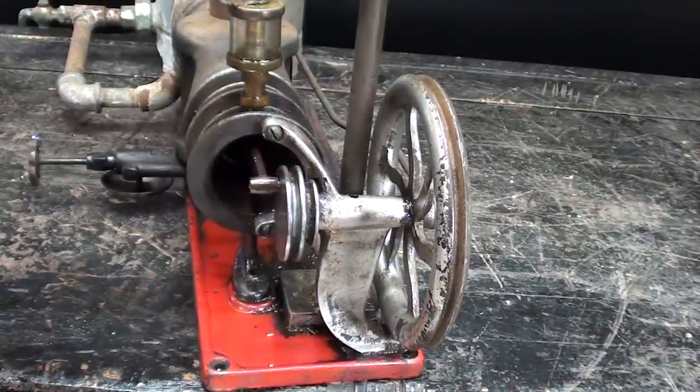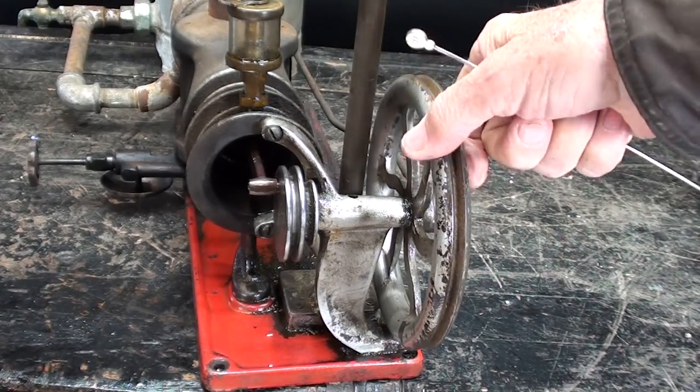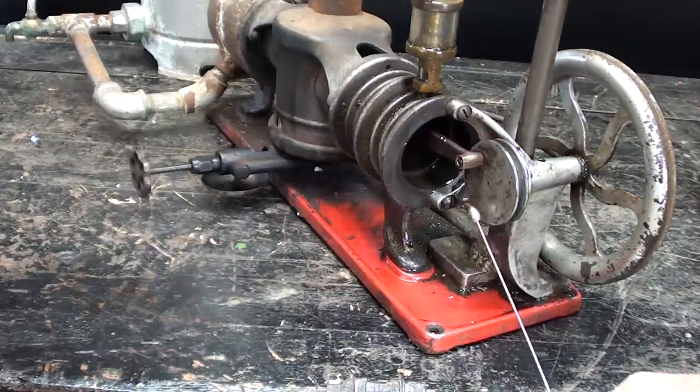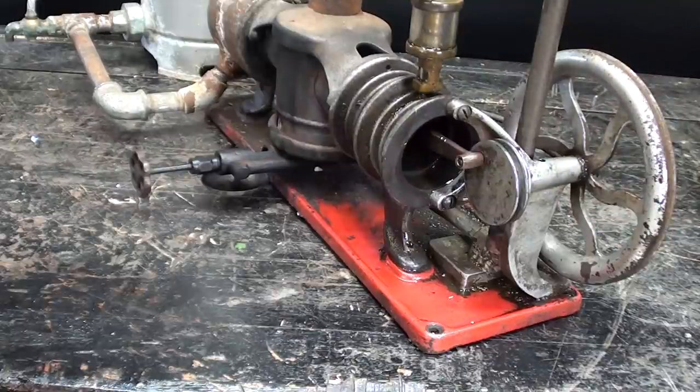The whole engine to me is quite beautiful. In addition to the drip oiler, there's an oil hole right here for the main shaft, and there's also an oil hole on the connecting rod. But someone has installed this brass connecting rod upside down, which I will have to correct — so the oil hole is on the bottom. I'm assuming it's probably about the same situation on the inside where the connecting rod fits into the wrist pin.